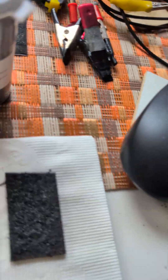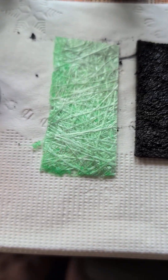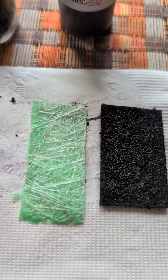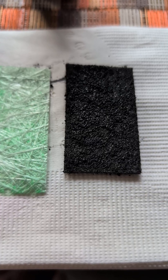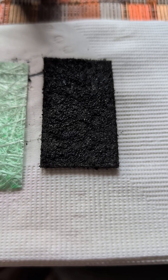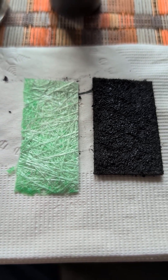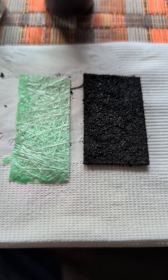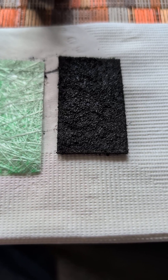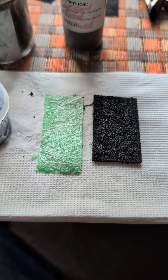The graphite felt has surface area, and by coating with activated carbon and carbon black I will boost the surface area — the carbon black will help with conductivity. Once I start to see any decent capacitance at small scale, then it's simply a question of increasing the surface area of the graphite felt. We'll keep you posted on our research. Thank you for watching. Bye for now.